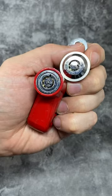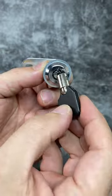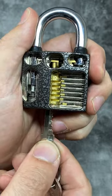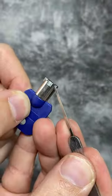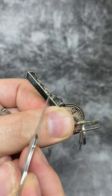These familiar locks are tubular locks, so called because the key is like a tube. You may have seen them on vending machines and the such like. They are very similar to a standard lock where the pins are all in a straight line, apart from in this case the pins go round the lock radially like this, and the cuts on the key are also radial on the tube, unlike a normal key where they are straight.